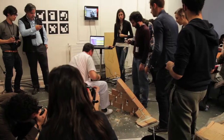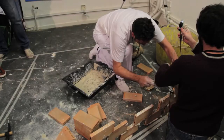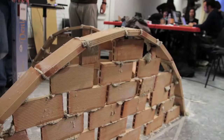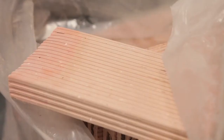We split into two groups — one was trying to start with the design of one of the vaults, and the other started to build the main arches. We are planning to finish tomorrow or in a couple of days. The problem today is that the form we designed was much too difficult to build with the size of brick we have here. So the idea tomorrow is to cut that form into smaller pieces and try to be more precise in the second vault than we've been in the first one.